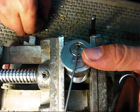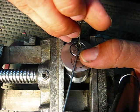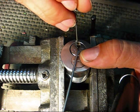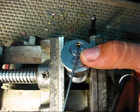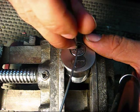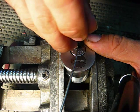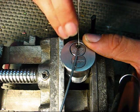Oops. Bad news. I'm getting a binding force on this first sidebar pin, but it's not significant enough to manipulate it really. There we go. That was one of the ones out of the vertical stack that just fell. I must have overset it. Looks like that's what happened.